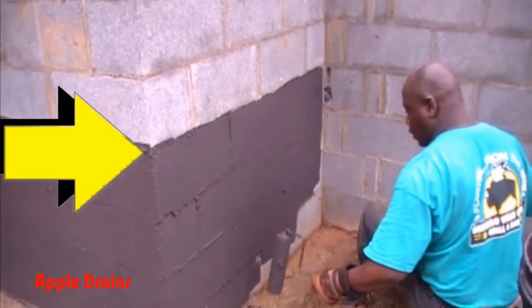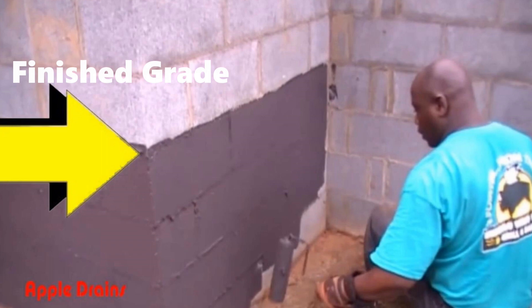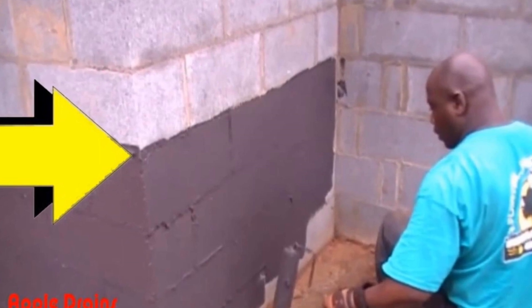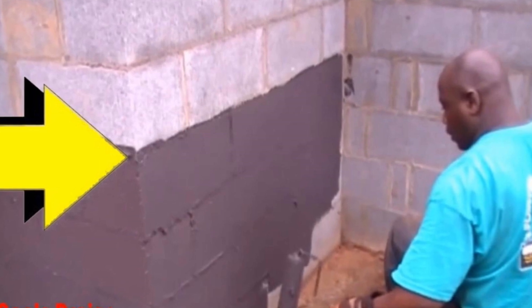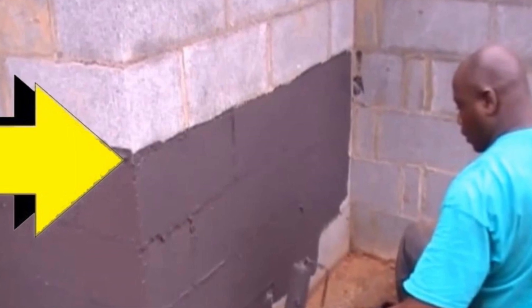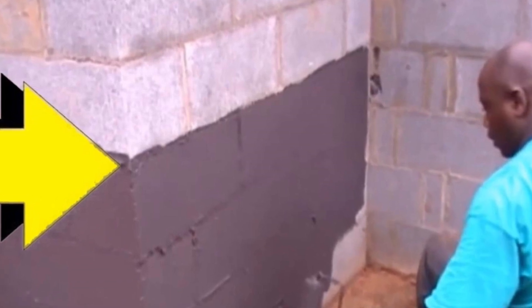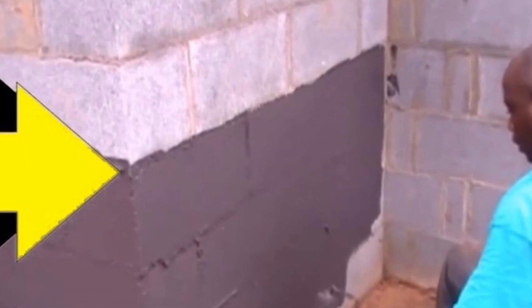You can see what we're doing is painting up to grade. Liquid rubber should be painted all the way up to a few inches above your finished grade — in other words, where your soil is going to be pushed back. The liquid rubber does make a great seal. It creates a rubber shell that stops water from penetrating the block. But by itself, it's just not enough. A lot of water still comes in at the footer level, so we need that footer tile to collect the water and discharge it away from the foundation.